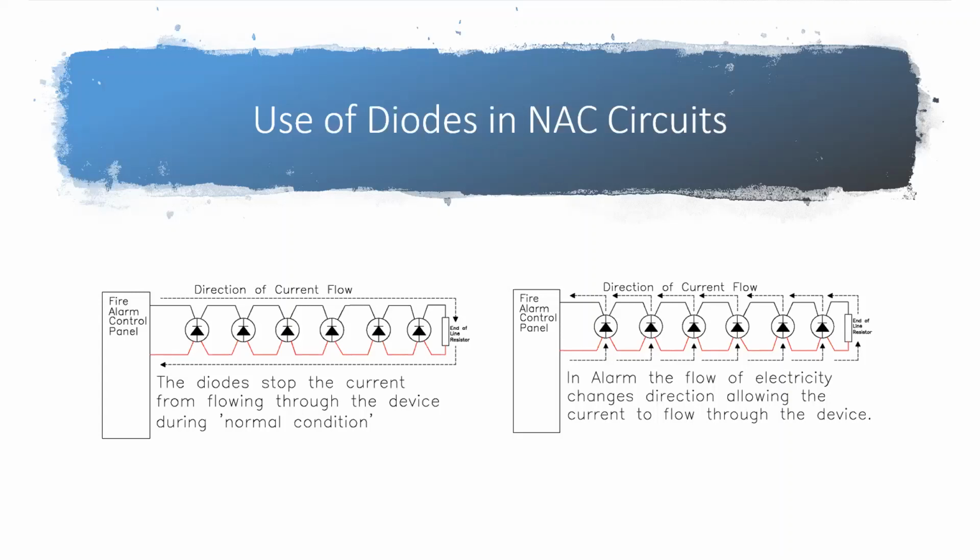So if y'all have to make a couple changes here or there in the field, like maybe there's a corridor that's a higher ceiling than I realized, and I have the circuit going across that corridor, but you have another circuit on the other side, and you can kind of trade devices between the two circuits. It gives you enough room to do that without worrying about overloading it. Don't do it too terribly much. Like, don't just completely redraw the circuits, because then all the voltage drop calculations kind of go out the window at that point and we're just guessing. But I do leave enough room in there for you to make some minor changes if there's some unforeseen circumstance.